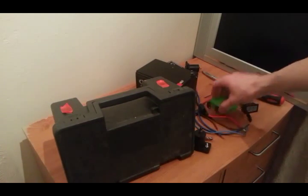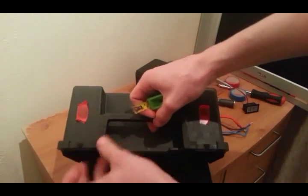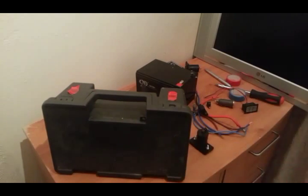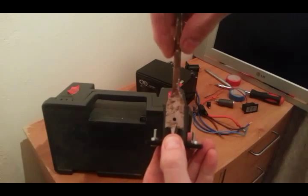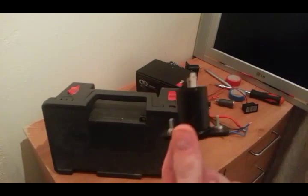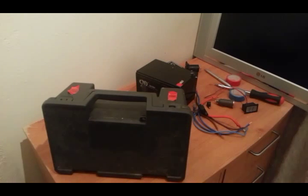What I've done here is use my tape measure and measured across and down from the side of the closed clip to the bottom. There's a small dot marked there and the same on the other side — that's the rough center of where I'm going to drill my holes. I don't have a drill bit the same width as the socket, so I'm going to drill the holes with the closest bit I have and then use a knife to scrape around the rest for a nice tight snug fit. It'll take a little bit longer but it'll look neater and be more waterproof.